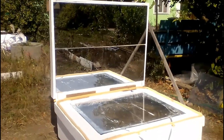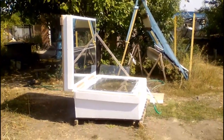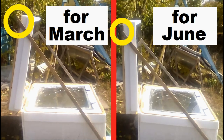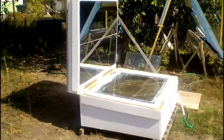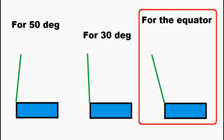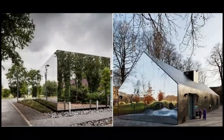I live at 50 degrees north latitude in Ukraine, where the height of the sun above the horizon is 45 degrees at noon in the first half of September. The height of the sun will change for other months, and I am showing the optimal vertical angle of the mirror for March and June. Here we see how I can change the vertical angle of the mirror, but this change increases the efficiency only slightly. Thus, the solar heater may work well with a constant angle of the mirror all months. This constant angle will be different for different geographical latitudes — for example, this is the optimal angle for the equator, this is for the subtropics, and this is the optimal angle for 50 degrees north latitude. Large reflective surfaces can have an angle of any value.